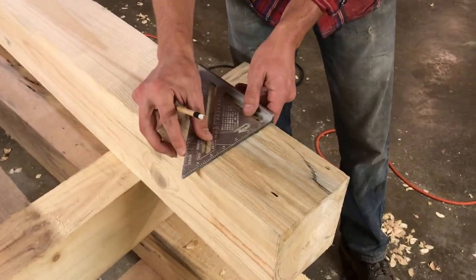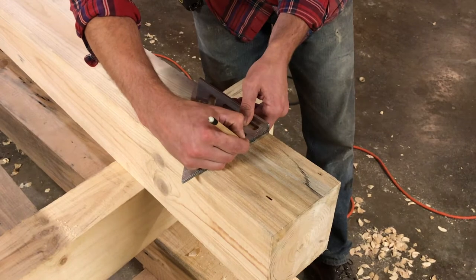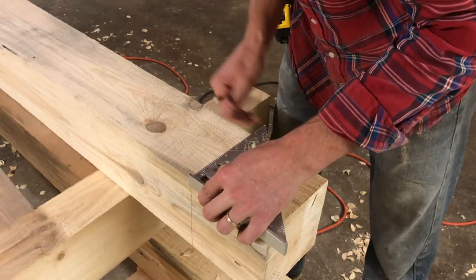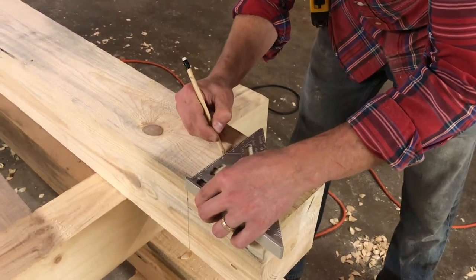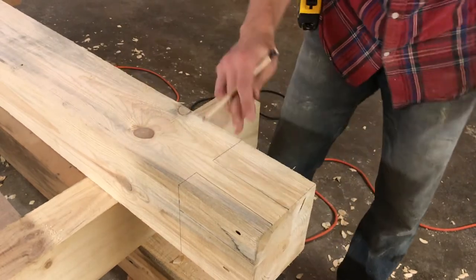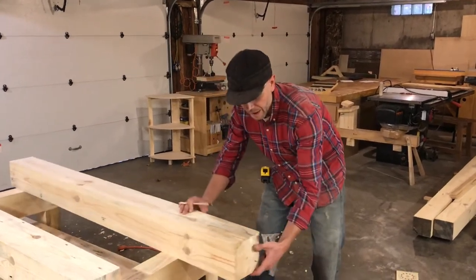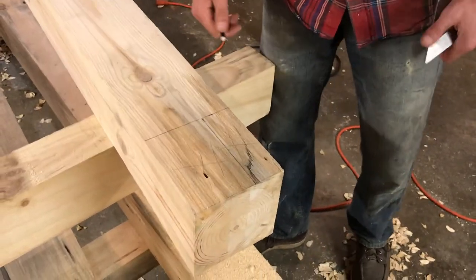There's our six inches — we'll use the outside as our reference. Then we need to come in two inches, mark that here and here, and connect these lines. We come down our inch and a half, and at the three-inch mark we take it the rest of the way down. It's often helpful when cutting tenons with waste spots to put X's on the material to be removed — so we'll mark this as waste here, and the entire top piece is also waste. I'm going to transfer this side measurement over to the other side and then we'll start cutting.